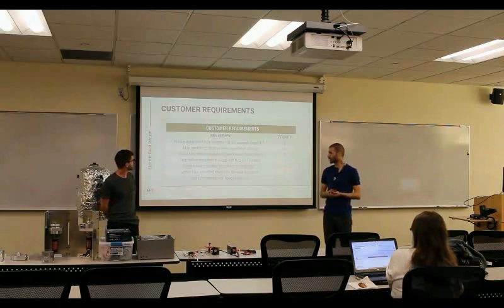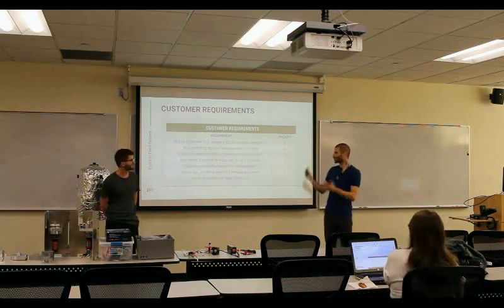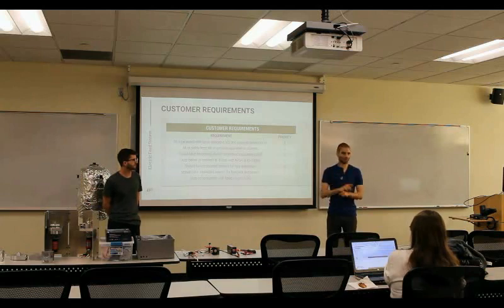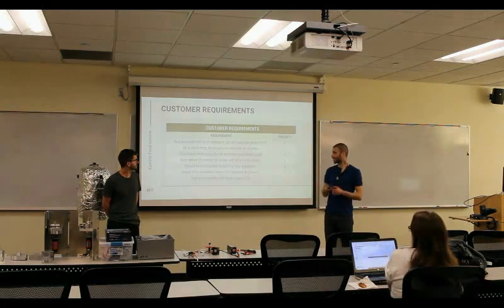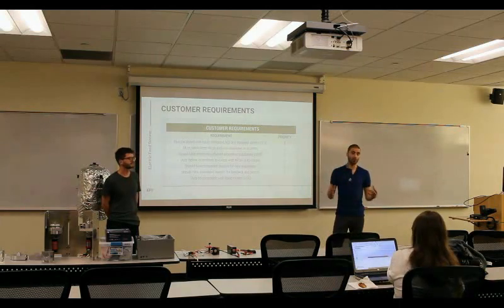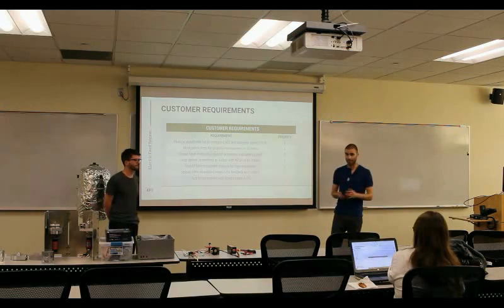These were the requirements we had at the beginning of the year, changing throughout the year, so this is the final set. We had to make sure the pumps were tested with the actual propellants. We couldn't do liquid oxygen because of insurance reasons, so we stuck with liquid nitrogen, which gave us cryogenic capabilities, and then isopropyl alcohol to test. For safety reasons, we had to make sure these pumps were designed to keep fluids separated — no leaks, no cross-pumping, no chance of fluids contacting each other, because these fluids are designed to combust. If they're premixing, that's a dangerous hazard.